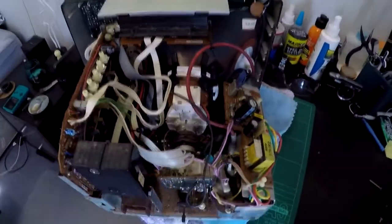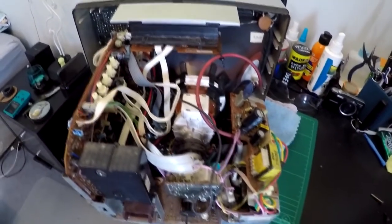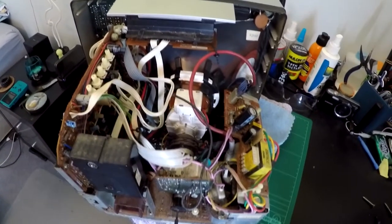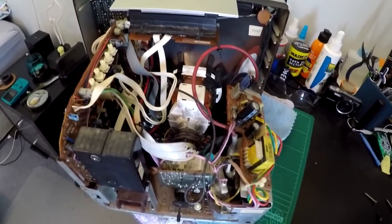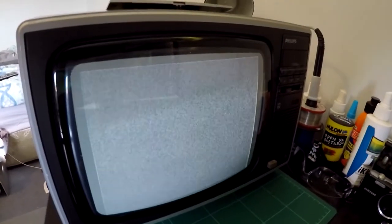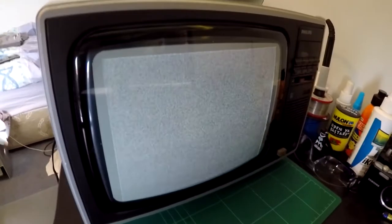So that's going to be a fun little project for a while, but what I'm aiming to do is work out the polarity of those 12 volt rails, see if I can work out how much current it's going to need, and just jam some power into it and see what happens. Bonus update — we have a functioning display. I just quickly jammed 12 volts into it, and lo and behold we've got some static.